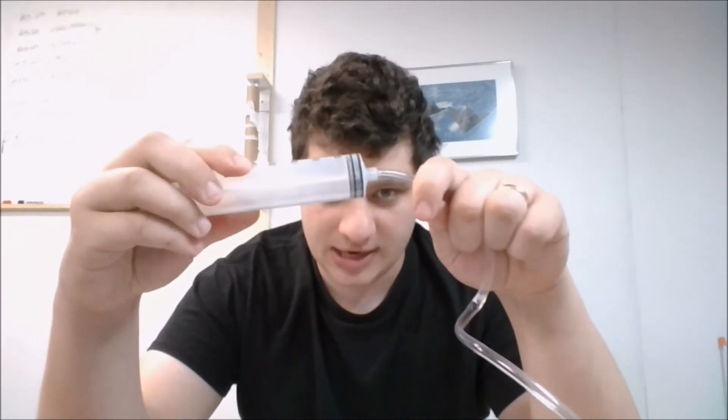I don't remember what the inner diameter on this tube is, but the outer diameter is a quarter inch, so that'll be our fuel line. We need some way to vaporize the fuel into an easily burnable mixture, and that's what we're going to do today. I think we can do this with a 3D printed nozzle. As I keep finding out, 3D printed parts are super porous and really bad for containing liquids, especially ones with variable viscosity like isopropyl alcohol. But that's actually okay — it might even work in our favor, because we're trying to vaporize the fuel. It doesn't matter if it leaks out the side or out the front.